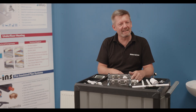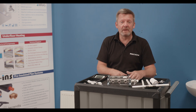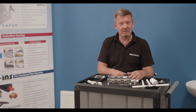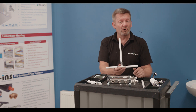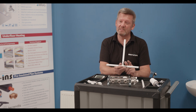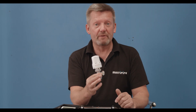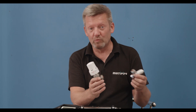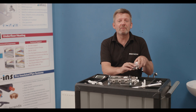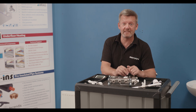Hi, I'm Martin from MultiPipe, and today I'd like to talk to you about manifold plumbing to radiators. In the UK, for many years we've traditionally plumbed radiators through branch plumbing, where there's a series of fittings usually buried in the floor — elbows, tee pieces, and couplers — which have potential leak paths. With branch plumbing, you'll normally terminate on radiators through traditional TRVs, thermostatic radiator valves, and lock shield valves, with one master thermostat controlling the operation of your heating system.